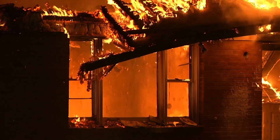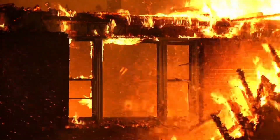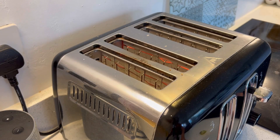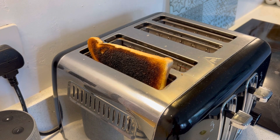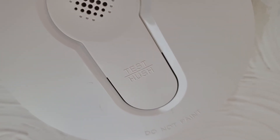An actual house fire is not the only reason the detector may be triggered. There are times when it may be caused by something as simple as toast being left too long in the toaster by those interesting people who like it mildly carbonized. To stop the alarm sounding in such cases, the test button doubles as a hush button and will temporarily silence the alarm for 10 minutes by pressing the button for longer than two seconds.